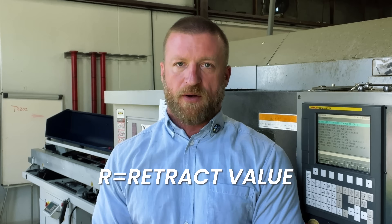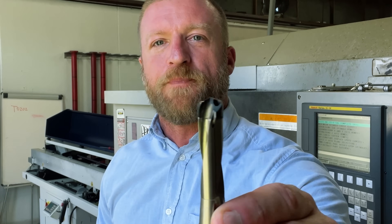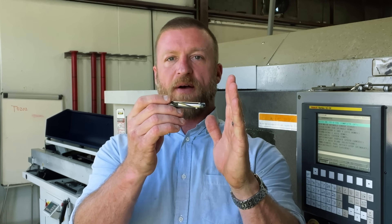There's something else you could put on there that I don't use often: an R value, your retract value. You're going to rapid a G0 to your approach point at X0 mostly, unless you're using a U-drill or an indexable insert tip. Whatever your Z approach is — your safe approach to not crash your part or tool — your R value could be R.1, R.05, R.5. That is how far it's going to rapid back out. So if you choose R.1 inch, you're going to come out one tenth. If you choose R.050, you're going to come out 50 thousandths from your approach value.